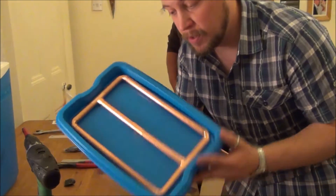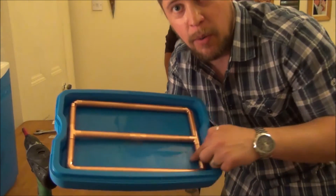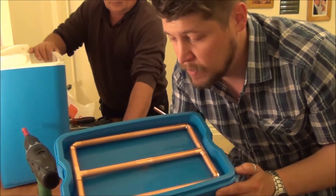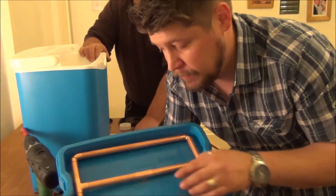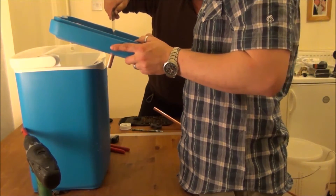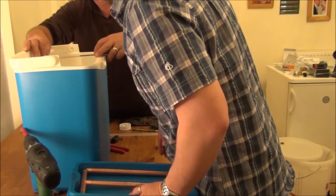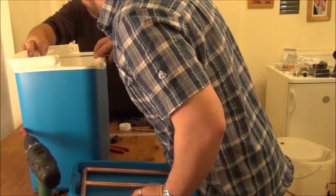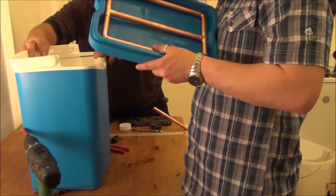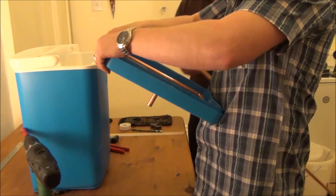So there we go — one sparge arm made and fitted, and we're just debating whether to put another row in between these so that we have more lines of drips. I think it would probably be worth it. If we look at where those are set, they are 180mm apart, which is actually a little bit in from the edges, so you're not running down the sides in particular. Another two arms wouldn't hurt.